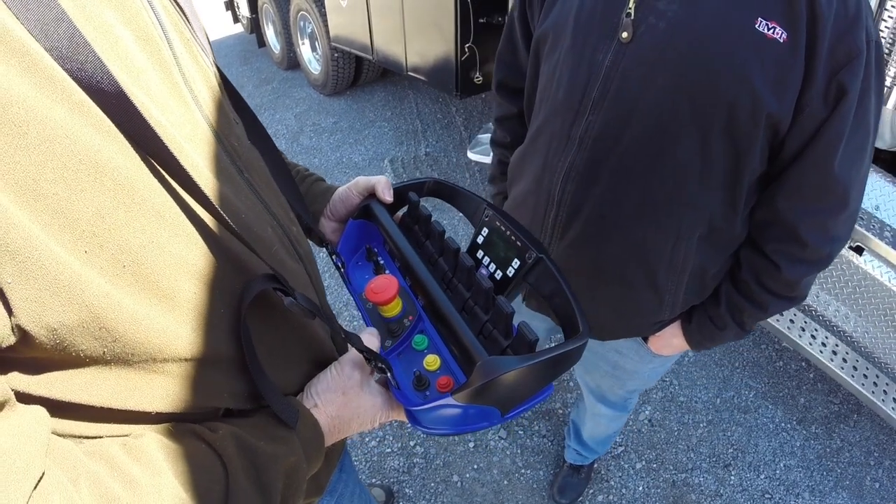The function light will show when you are in HDL mode, which is our heavy duty lift mode. Heavy duty lift is going to be 50% of speed — not capacity — and it's going to proportionally engage while you are running it from 70% on. You can also put it into manual HDL by touching the red button on the transmitter or on the RCL.